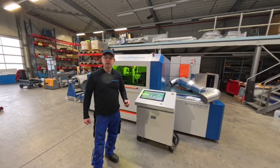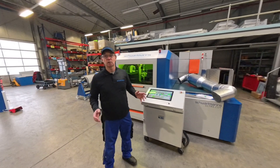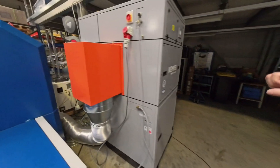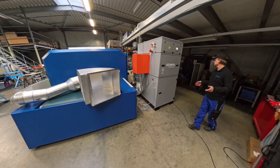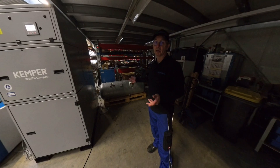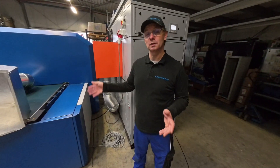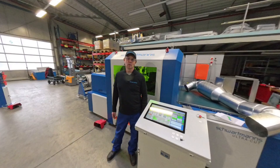The machine has a total length of 4.3 meters, a depth of 3 meters, a height of 2.1 meters, and weighs 4 tons. Behind the machine are the accessories that come with it: the suction unit and the water chiller. Optional — and not included — is the air compressor. It needs an air compressor of 10 bar, which you can order separately or have Schwartmann's include it. This machine doesn't cut with nitrogen as that's too expensive — instead it uses air from the compressor.